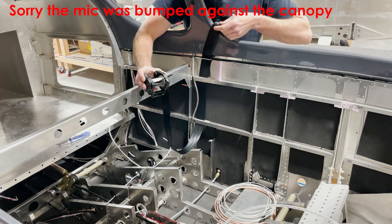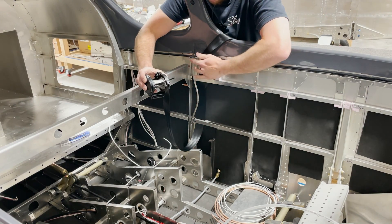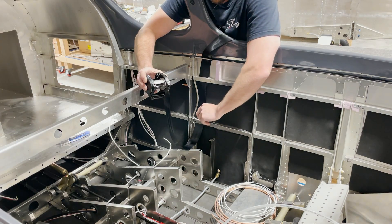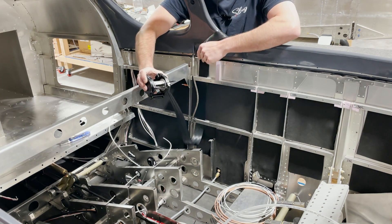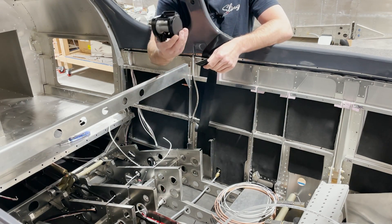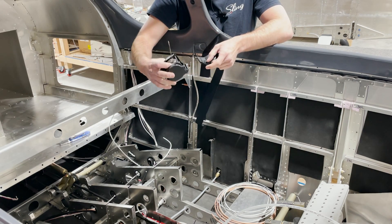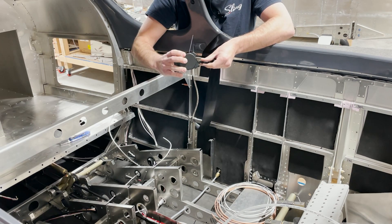As you can see, we've run the seat belt through the three side rails here with edge protector on all of them. That ensures the seat belt doesn't slowly get marred by the sharper aluminum edge and allows a smoother slide along the aluminum. Once that's done, we take our seat belt retractor and run the seat belt back through it in the same way it came out.